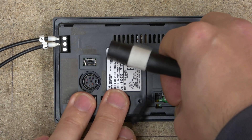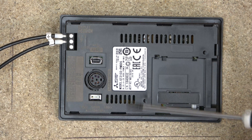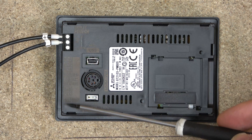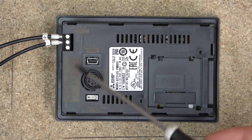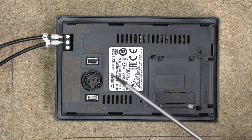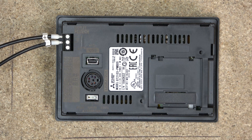This part here is where you can add an SD card. This is the cheaper, entry-level version of the screen — there are additional options like an Ethernet port you can have and other bits like that. This part here is where you communicate with your PLC, and in GT Designer 3 you select which controller you're going to be communicating with. This is the older connection for communicating with your PC — we're not going to use that cable because there's a USB connection which we'll be using.